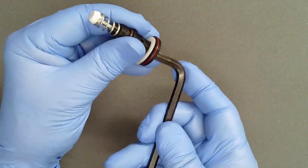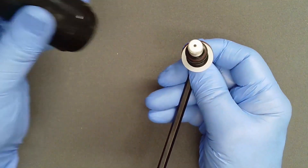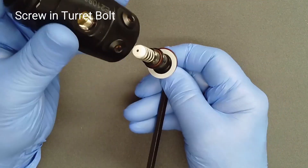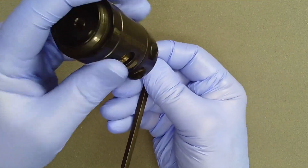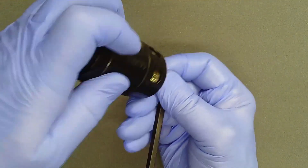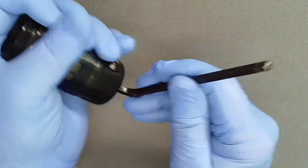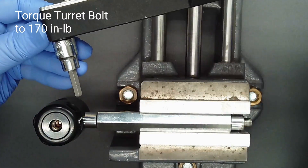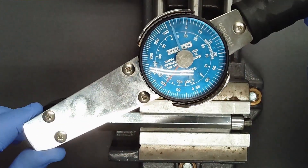Place the turret assembly upright on a six-millimeter hex key. Carefully invert the main housing without dislodging the turret. Carefully insert the turret bolt so that the high pressure seat stays centered in the bore of the main housing. Putting pressure on the spring holding the high pressure seat, engage the threads of the turret bolt and screw it hand tight. Using a straight shaft hex socket, torque the turret bolt to 170 inch-pounds in a single smooth motion.